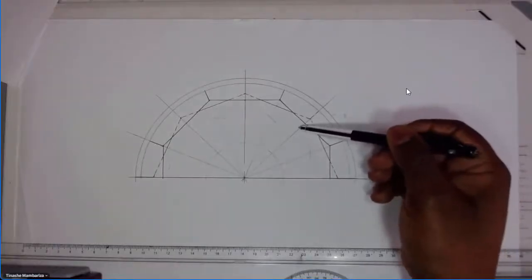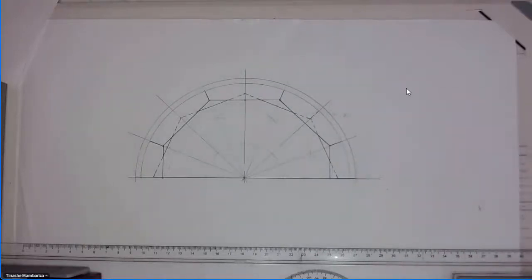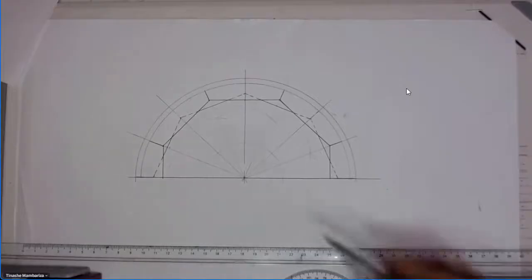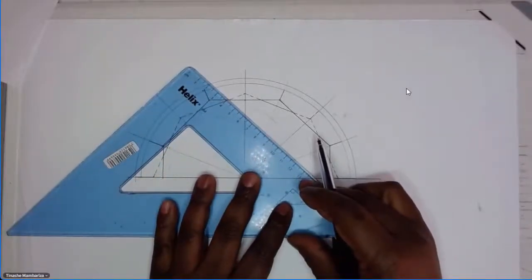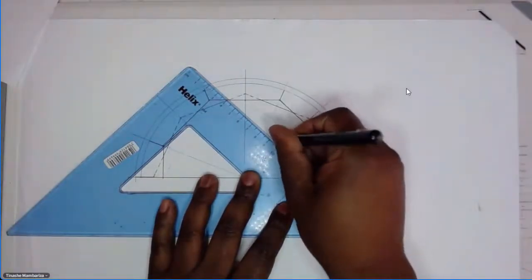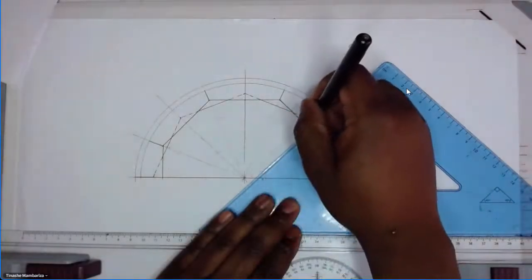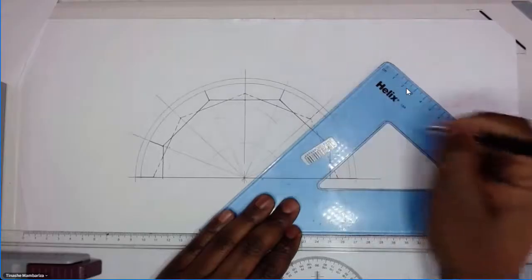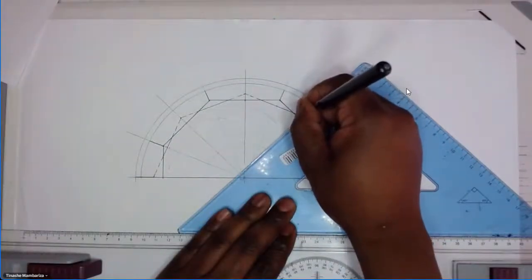So with this 114 by 38, you are going to spread that 114 on either side equally. So that 114 becomes 11.4, then you divide that by 2, 11.4 divided by 2, gives you about 5.7, which translates to 6 millimeters on either side. So 6 millimeters on either side means I am marking a point here, and I'm also marking another point there. Right, so I'm going to just draw construction lines for now, but that detail will be going inside, and the same applies here. It's going to be going inside like this.